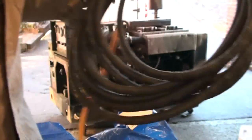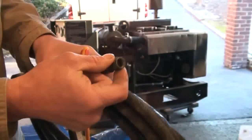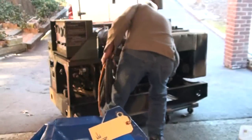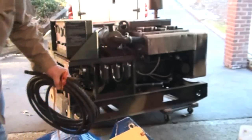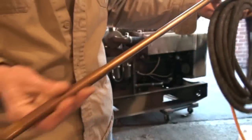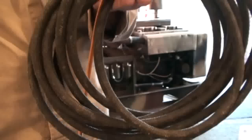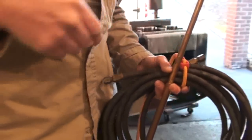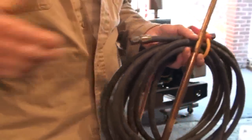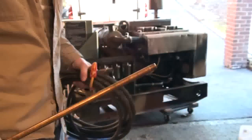The generator came with what the army calls an auxiliary fuel line. There's a fitting on the generator that one end connects to, and it screws into a pipe that goes into the oil tank. The generator has a fuel pump on it that will suck directly out of my home heating oil tank and fuel the generator — I don't even have to pump it out and pour it in manually. It's got 25 feet of line, and I could extend it with any kind of fuel line and suck diesel right out of a truck, a car, a 55-gallon drum, or my own home heating tank.